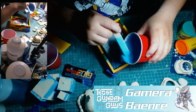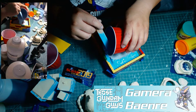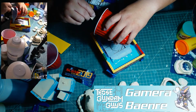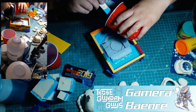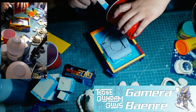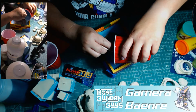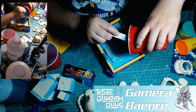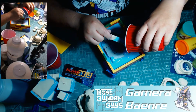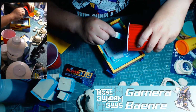I don't want to pour too quickly because then I might create air pockets. I'm not too concerned about that because I will be putting this into a pressure pot to finish curing once I'm done pouring all this silicone out. I don't think I'm going to fill it to the top. I'm actually pretty sure I'm not going to get it all the way to the top. But, again, silicone sticks very well to itself. So I just need to pressure cure this.